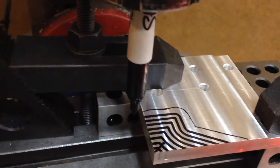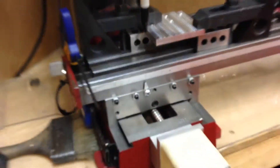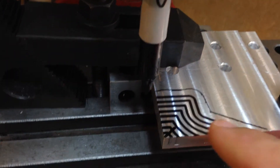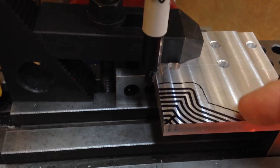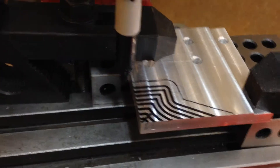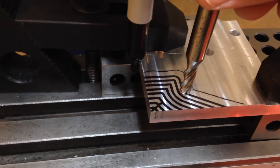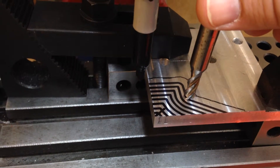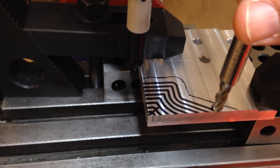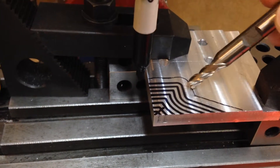Well, what do you think? Not too bad, huh? Just one quick reminder here — it kind of threw me off for a second too. The reason the black lines don't go all the way to the edge is — well, first of all, I think these edges are pretty much correct although I hand drew it — but you've got to remember that there's a thickness to the cutter. So that's just the center. The center of the cutter will go there, and so it actually cuts a little more to the right.